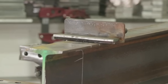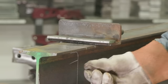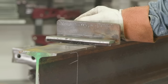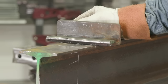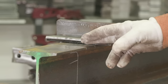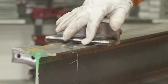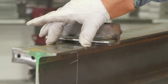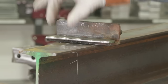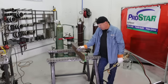I want to cut these flanges and just pierce these. I may move across this one just a bit quicker because I don't want to pierce into this web here. I may accidentally do that but it's easily repairable. I'll show you what I'm talking about when we get into these cuts. The first thing I want to do is go across the flanges. I've laid this out so that this is my length in here and this is how much the flanges are going to cut back. I need to make two cuts across here - one for length, one to get rid of this flange. It doesn't matter which one I make first, so I'll start with this one here.